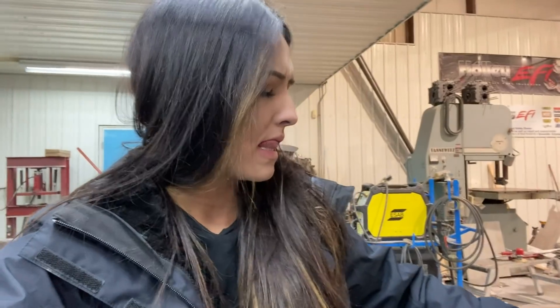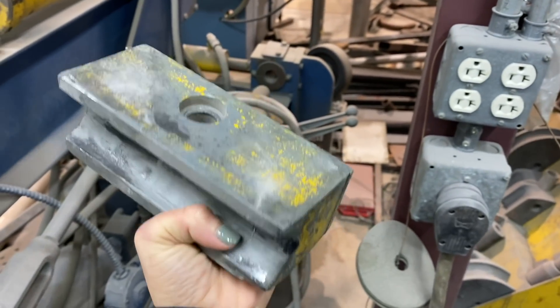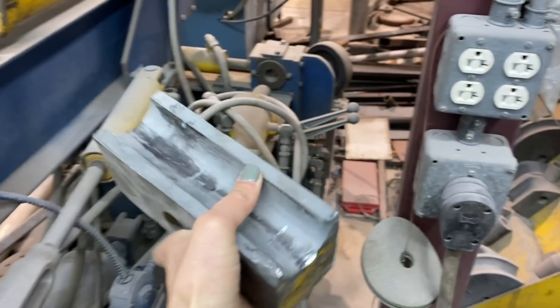Got the casting part done. Just making two grooves, that's all he's doing. I happen to have a bit that is actually an inch and a quarter — so just drilling down and making the groove, whereas the other would have taken quite a bit more time. Just so you know what I'm talking about — this is the die that we would have had to make, or not the die, the shoes. The other side with the two pieces and this part bolted on would have had to drill a lot of holes in that chunk that we cast. Here, basically what he's doing over there is just making one that's the right size — inch and a quarter. It's so much easier, just a block and a lot quicker.